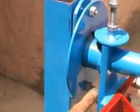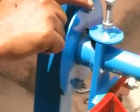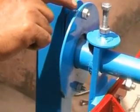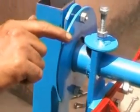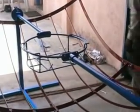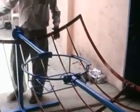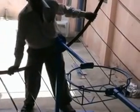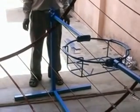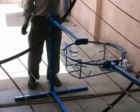These two bolts are the clutch bolts — these are the most important bolts because the clutch operates on the tightness of these bolts. If they are too loose, the entire reflector will not remain in its desired position. If they are too tight, we cannot tilt the reflector. The clutch bolts are tightened to the extent that just by pressing the reflector end it should retain its desired shape. To focus against the sun we tilt the reflector and wherever we put it, it should remain as it is without falling — it should not change its position. This is the function of the clutch.